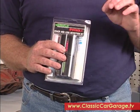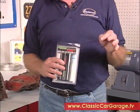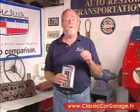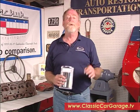You can take this little kit with you to a junkyard or a swap meet and check out parts for minute cracks anywhere you happen to be, and it'll also check aluminum and other non-ferrous metal parts. You can check bearing saddles, engine blocks, cylinder heads, and even spindles and other structural parts.